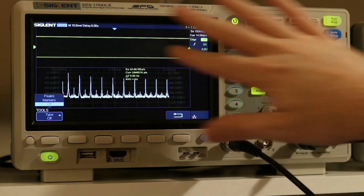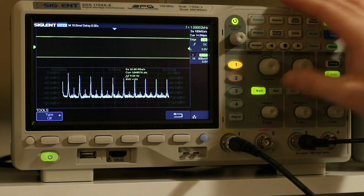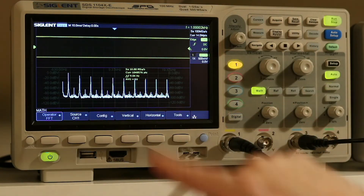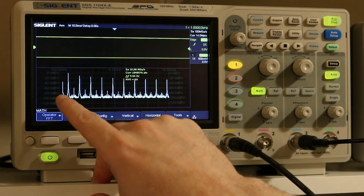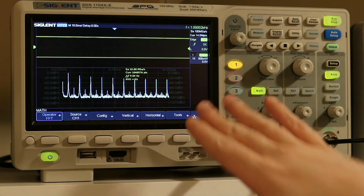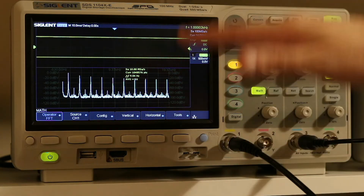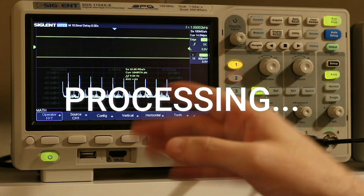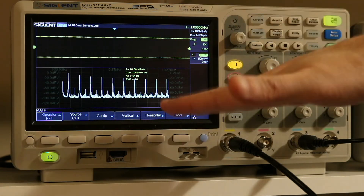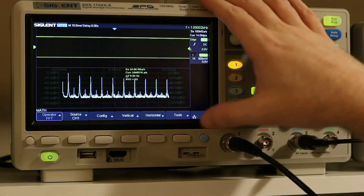So essentially what I wanted to show you is this FFT. We've got a square wave here and our time base is 10 milliseconds, so we're sampling a good long duration of that square wave. We've got an FFT that is basically covering the audio frequencies. This is our primary one kilohertz signal right here. We're primarily concerned with the upper harmonics, and the scale on this axis is dB volts — frequency across the horizontal axis and dB volts on the vertical axis. What we're seeing here is the harmonic content of that square wave — square waves have a lot of harmonic content.